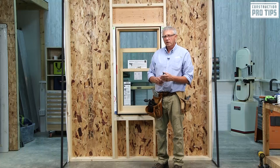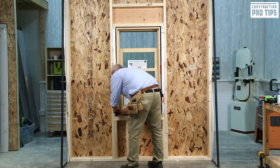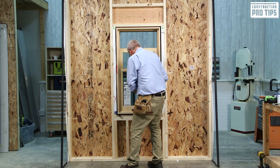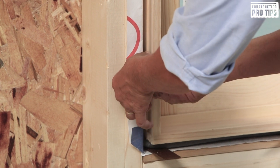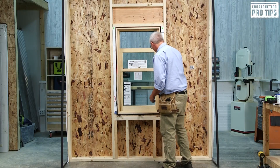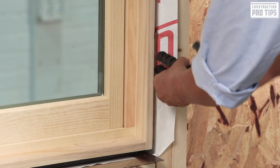The next step is to shim. I'm going to use stackable shims. With a half-inch clearance provision, I'm going to start by applying my shim at the corner — I notice it's a pretty loose fit, so I'll grab one more shim to put alongside. I want it to friction fit. I don't want to force it — they should just press into place. That's four to six inches up from the corner. Going to the next corner, I want to pressure fit them in as well. With the guide and use of an air wedge, that can be done quite easily.